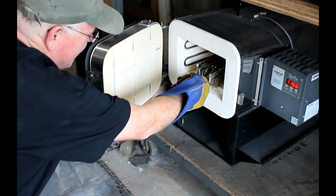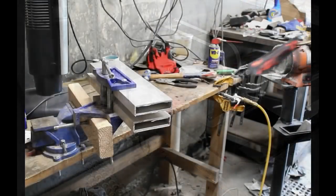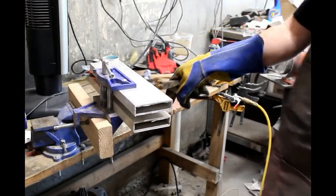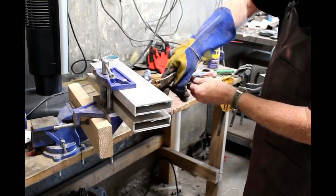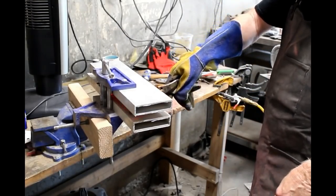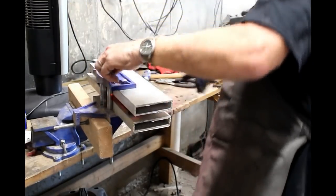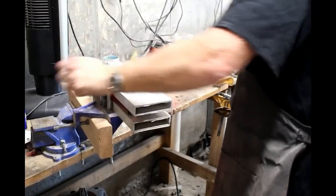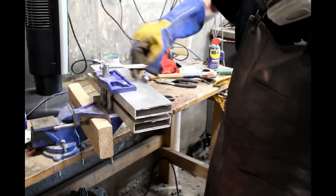All of these blades are AEBL stainless. I let them run through a total heat treating cycle, then plate quenched the knives. I use aluminum tubing secured onto a carpenter's vise, and I'm able to clamp down on that device so both plates come together on the blades and really prevent warping.